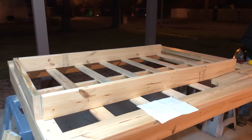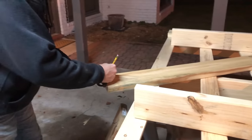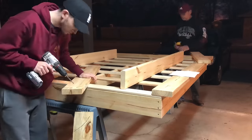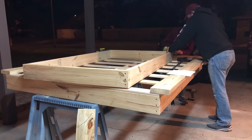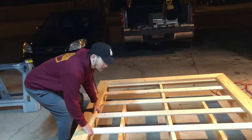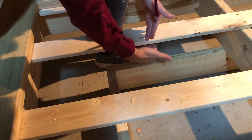For the bottom base, we have two cuts: two pieces at 68 inches and two pieces at 41 and a half inches. These are already cut, so we're going to mark them, pre-drill, and assemble just like we did earlier. But the sun beat us today — we have to come back tomorrow. Tomorrow we're addressing the wobbliness. The bed is so wobbly it would fling you across the room, so we need to put more two-by-sixes underneath to create a connection point from the bottom frame to the top frame.